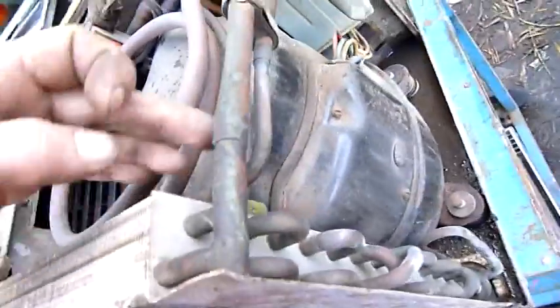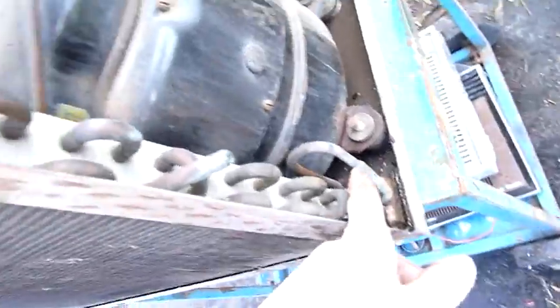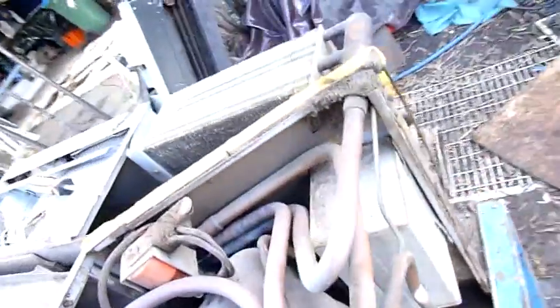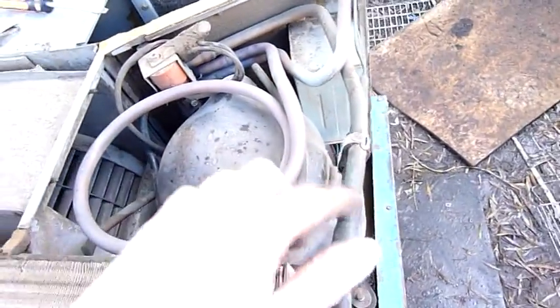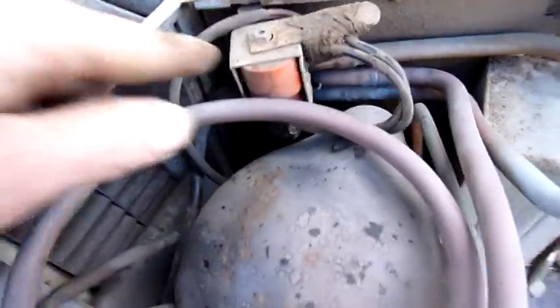So what have we got? There's a capillary line coming out of there — that's liquid out. It goes all the way around the coil, under. Liquid comes out, comes back up through here and out through there. There's a charging point. That's discharge from the compressor going through the reversing valve. Everything's very tightly packed, it's all crammed in here. Blower box.